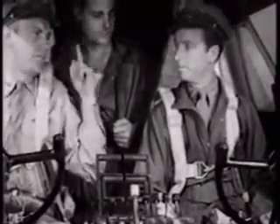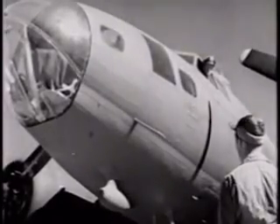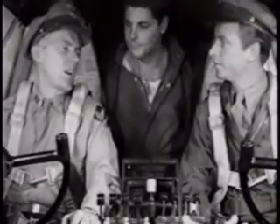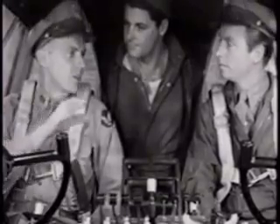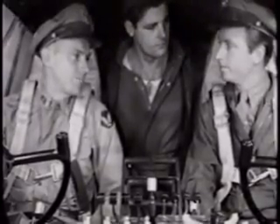Signal to start number one. I got the okay, but I couldn't see the guy with the fire extinguisher. He's in back of the engine. You see, it's easier for him to direct the extinguisher into the engines from there, through the open cowl flaps, and there's less danger of his getting excited and running through the prop in case there is a fire.